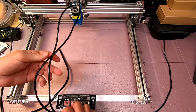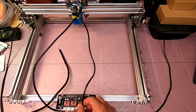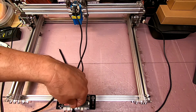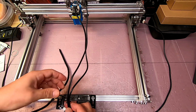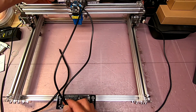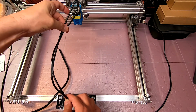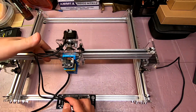If you know what that term means, strain relief means that at connections like this, the wires aren't pulled up hard against the connector, where it's going to potentially crimp over time and fatigue. So I'm going to want to make sure that these are bent, and one way to do that is attaching them together like this, equidistant from each other. Another thing would be, as I was mentioning with the whip antenna, probably just have a piece of wire that comes out from here and attach it at the end of the music wire, and that way this can traverse back and forth like that.